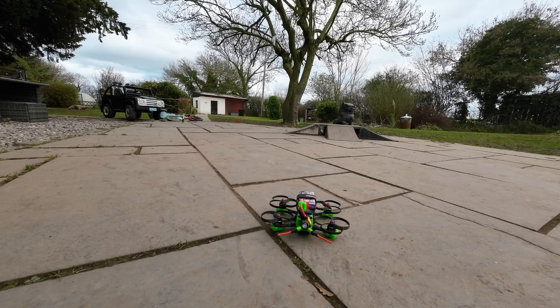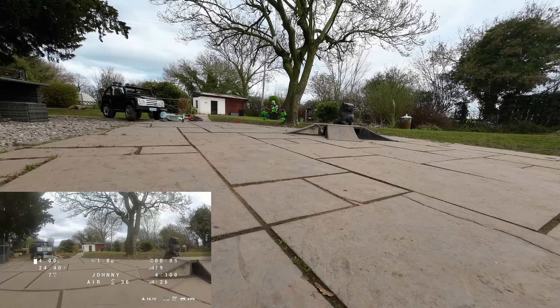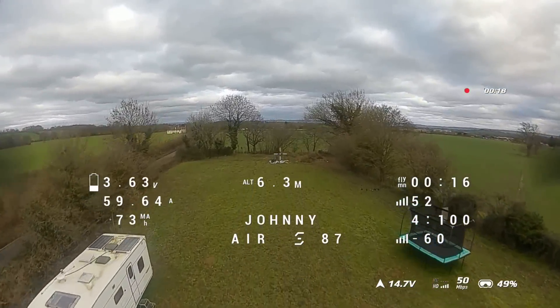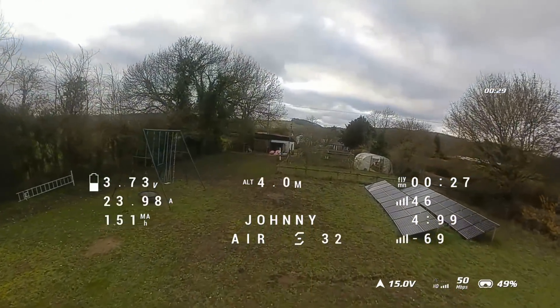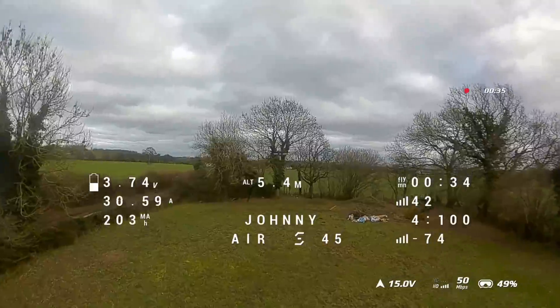Session two, recording in the headset. Let's have a bit more throttle and be a bit braver with the flight — see if we can get some flips and spins, but this time not apply so much throttle as we're pulling out of a flip. It's definitely helping with the lower D gains. The last prop must have shattered when it was recovering from a quick spin.